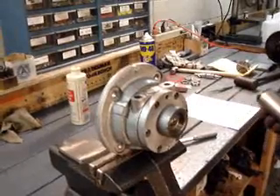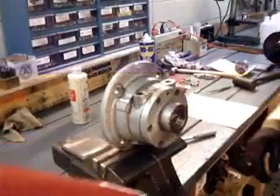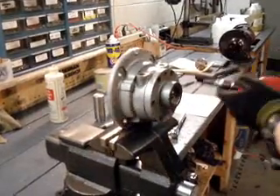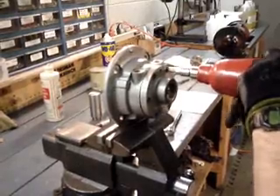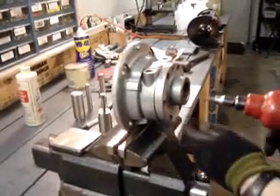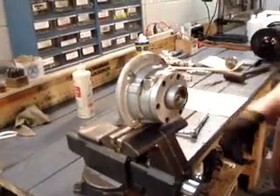Then we're going to use our disassembly tool that works as a gear puller. But prior to that, we have to take these six screws out. I'm going to use an air gun to remove those screws, but if you don't want to use the air gun, you can just use your ratchet with the same number three Phillips head. The air tool makes it a little quicker to take it apart. I'd recommend using the ratchet during reassembly though, because you can monitor the amount of torque that you put on it.